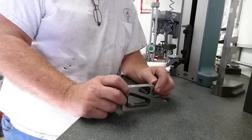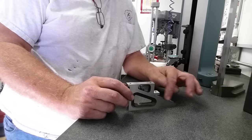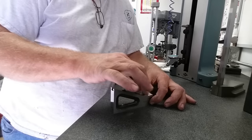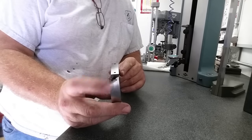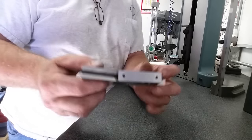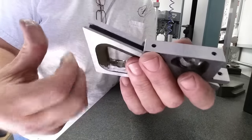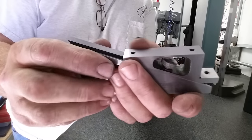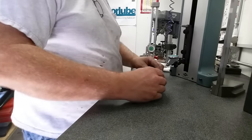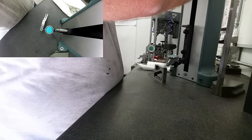Okay, we're back from the surface grinder. We've machined our top and I've taken it apart, cleaned all the coolant and grinding schmutz out of there, and put a little one drop of way oil on the slider and the guide. There's the grind — I'll show that to the camera. I've stoned the edges — and even took the time to cut myself before I stoned the edges. So let's check this thing again and see if we got rid of that funny side-to-side stuff.